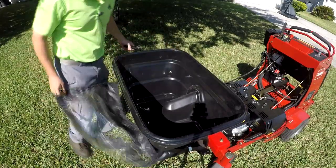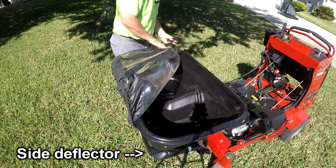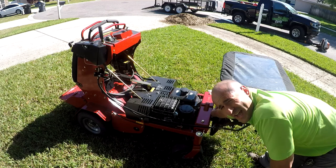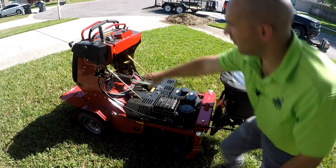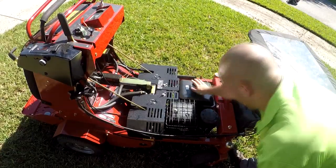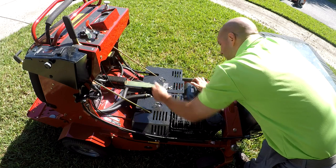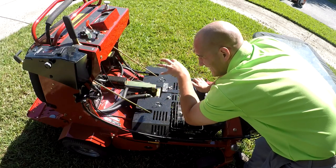There are a lot of good benefits to having your aerator and spreader combined. You've got a nice cover for whatever materials you have, and the hopper on this is big — I'll put on screen what it can hold. After you've filled your materials, you can cover it back up so no water, bugs, or leaves fall in. From here forward is the spreader section. There's about an inch-and-a-half or two-inch hitch on the front of the aerator for different attachments. The cabling runs to a control unit that ties into the aerator's battery. We've got the gas tank, air filter, and exhaust here. Here are your hydros and release levers, access panels, and the linkages that steer the machine. This piston is what drives the aerating tines down into the ground.